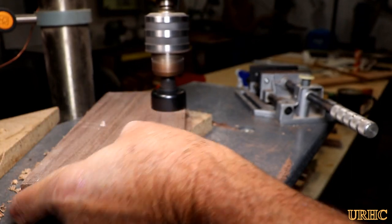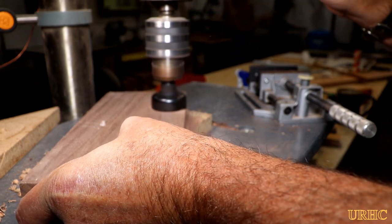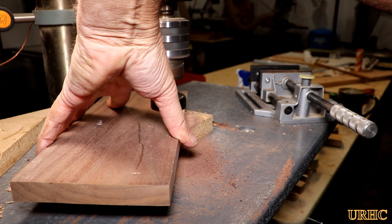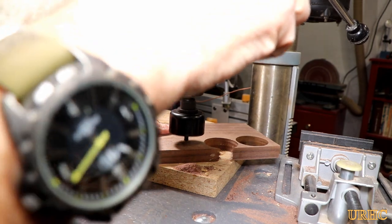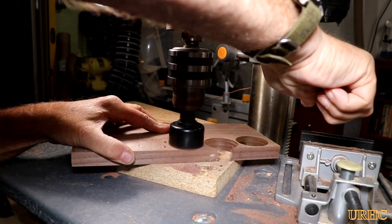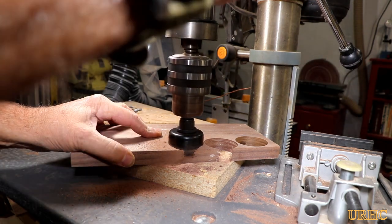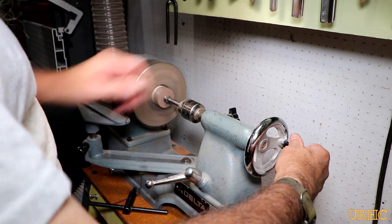The parts were started, but I decided to make the peg-end caps round instead of hex nuts because I didn't want them to pull on a robe or put marks on clothing. So I took an old hole saw and started cutting crown plugs from a piece of walnut. When using the hole saw I try to get it so the saw is cutting just barely off the edge of the block of wood, so the sawdust ejects out of the slot as you're drilling and doesn't burn or stick things together.